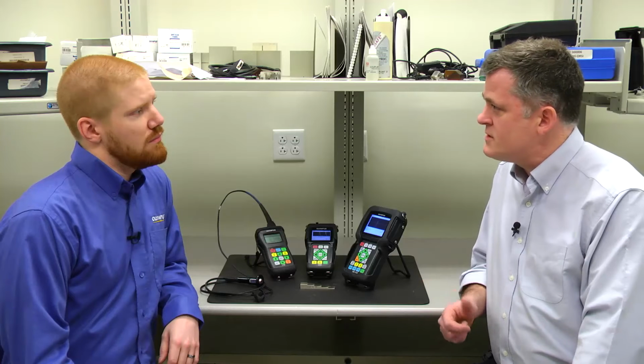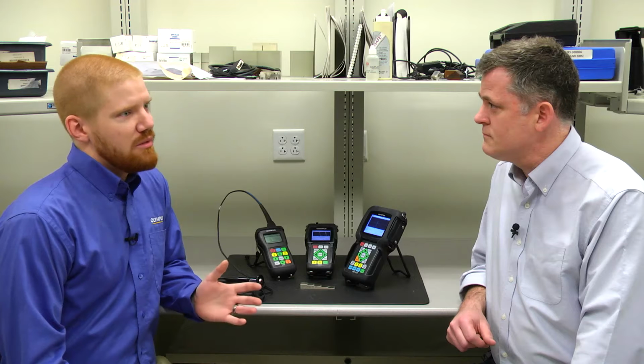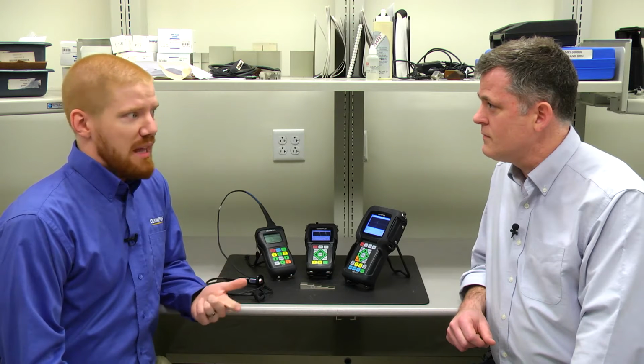I wanted to learn a little bit about our thickness gauges and the difference between our gauges. Can you tell me the difference between corrosion and precision thickness gauges? Sure. With thickness gauging, it really comes down to the applications. Precision, it's going to be new materials, usually for quality assurance purposes. The materials can range from metals, plastics, composites, rubber, etc. Corrosion, it's when you have an irregular back surface, corrosion, erosion type applications. This is typically just metal.